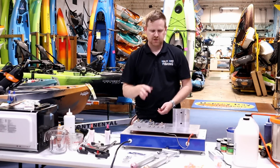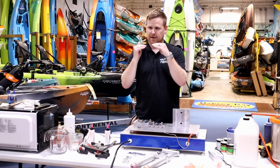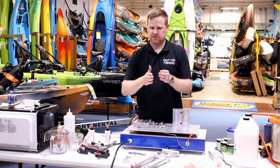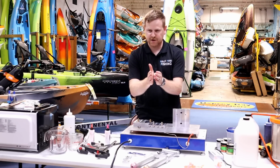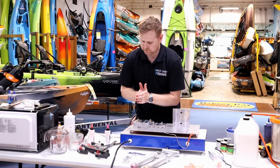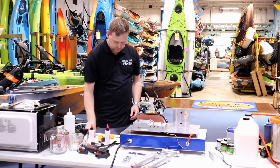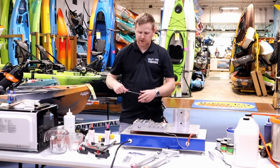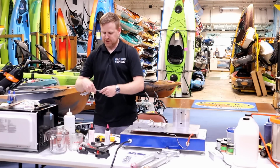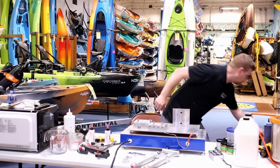In order to get the most even laminate, you want even temperatures and also lower temperatures. That way the viscosity is more ideal. The plastic's not going in there so liquid and hot and thin that it's not gonna mix together. You want the plastic to go in and just kind of marry each other but not mix together. Now in laminates, you normally have more waste, more leftover. So you're gonna get a little bit less number of baits out of that gallon, and I'll show you why.